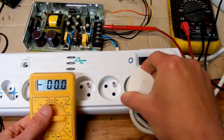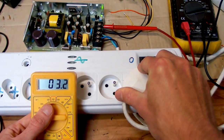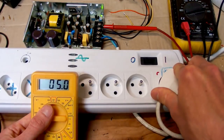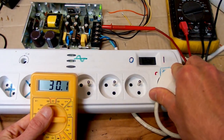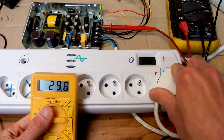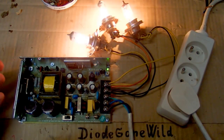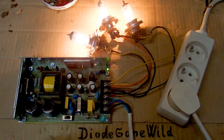And the power consumption with no load is about 3.1 watts, and the 10 times more sensitive socket says about 3 watts too. But of course it's a power supply with a bipolar transistor and no control chip. The ones with a MOSFET and control chip are generally more efficient and draw less power with no load.